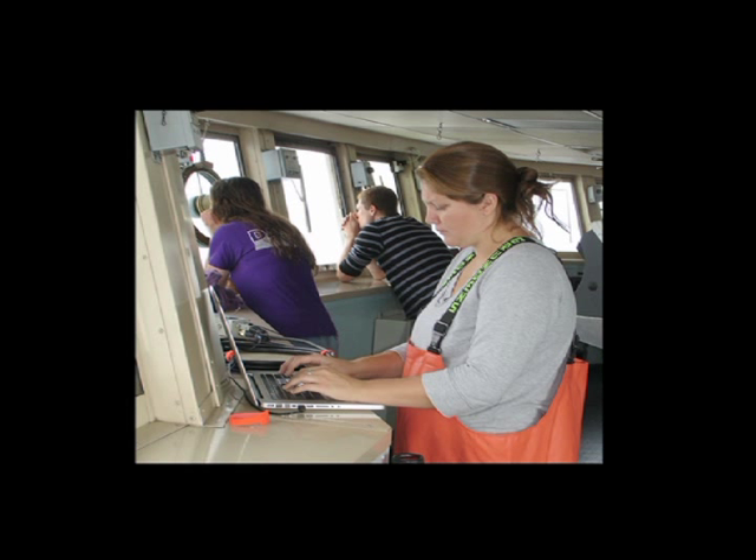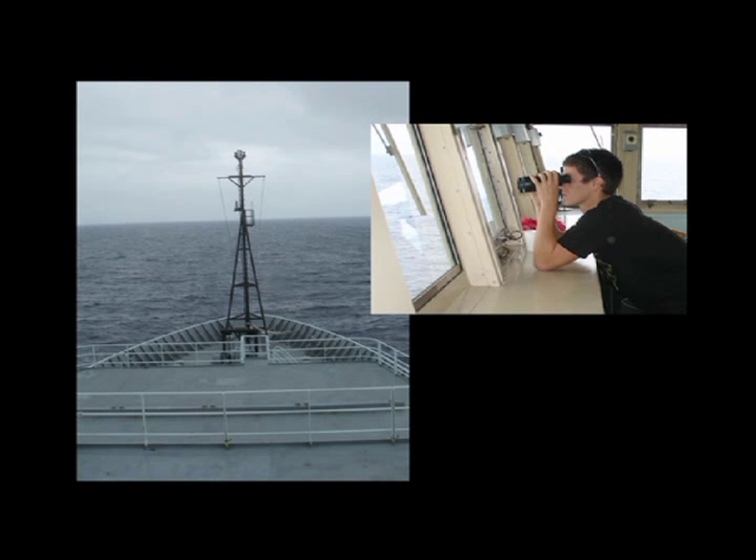Here we have the day of the recovery. The glider that we deployed was a 1,000-meter glider, so it was consistently doing yos from 0 to 1,000 meters — this is what we call a deep glider. Our glider was only equipped with a CTD for this mission, but it collected that data continuously during the eight days it was deployed, and all of that data, once we get it back, is housed live on our websites. On the day of recovery, we go up into the bridge, and I'm standing in front of my laptop because once I pick up the glider on FreeWave, I can directly interface with it. During recovery, I'll literally type the word 'where' and it'll give me back its exact latitude-longitude. We had a couple spotters on the bridge helping look for the glider to make sure we're not either going past it or that it's directly in front of us. Once the glider was in sight, we again lowered the small boat, did small boat ops, and just pulled it back on the boat and called it a day.